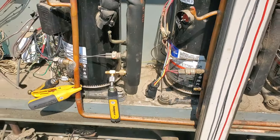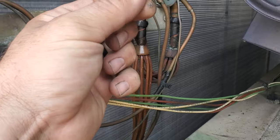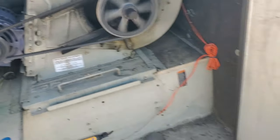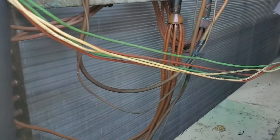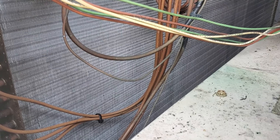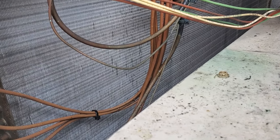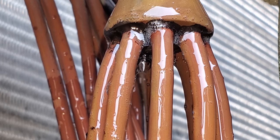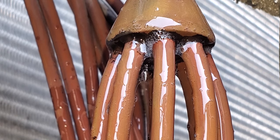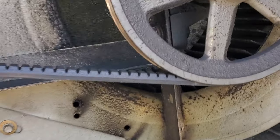I better jump onto the first stage and see how that one's operating. According to their charts the first stage is low, and the approach is low — that's weird. Let's go take a look at the TXV. This TXV is covered in oil. First stage TXV is covered in oil — that's weird. Let's power this guy down and grab some big blue soap bubbles. I'm going to spray it on where you're not creating bubbles, just coating it. I can already see leaks — the distributor has a big fat leak all over it, it's on the back side too, bubbling everywhere. That's a refrigerant leak.